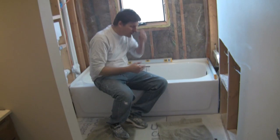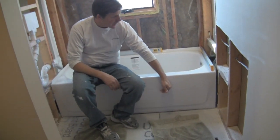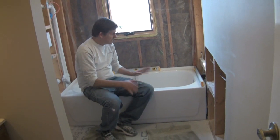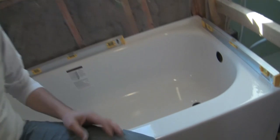We just dry fitted the tub just to see how things line up. Everything's pretty good. We're going to shim it up about an eighth of an inch because it's just slightly not level — it's higher in the back than the front, but just marginally. If you look down in the drain, you can see where our pipe is. Our pipe is right there, and I'm going at an angle — that's more straight down. So we've got to adjust the plumbing to get over to that, and that should be no big deal. Now we know it'll work.